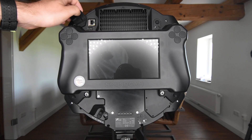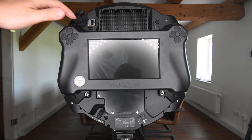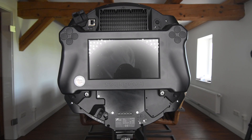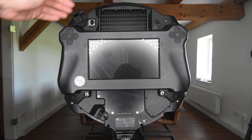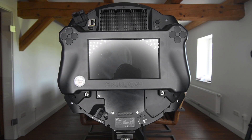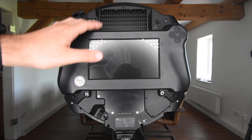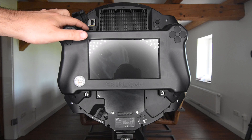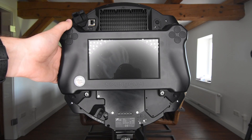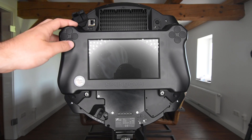Here in the upper left corner you find the network and the USB port. The network port is used to connect the Sound Cam to a network, and with a PC you can access the Sound Cam directly. Instead of taking the measurement on the control unit you can also take the measurement directly on a PC. The PC software is technically and optically identical to the software on the device. With the USB port I can directly access the internal memory of the Sound Cam and copy measurements stored internally to a USB stick in order to play them on the PC.